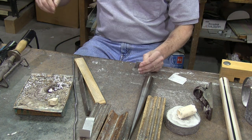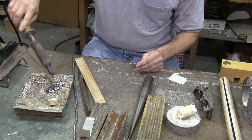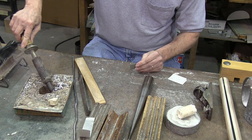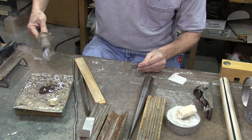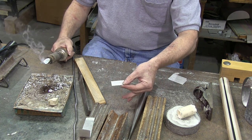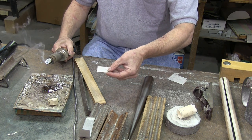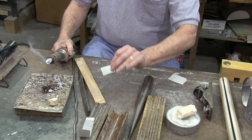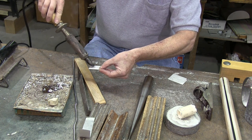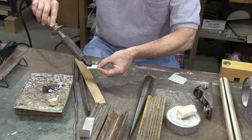I'd like to give you a little demo of what happens when you don't use the size. Here's an iron that's pretty hot now, and you can see it's melting solder very easily and putting up some smoke. And here's a piece of metal like we would use for the languids on this pipe. And the top side of it has the painting on it, and the bottom side does not. So you can see there's molten solder on this iron, and I'm going to put this right here against this and kind of rub it around and try to get it to melt through.